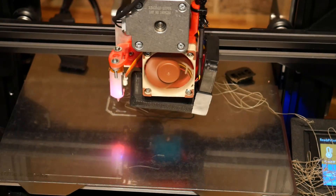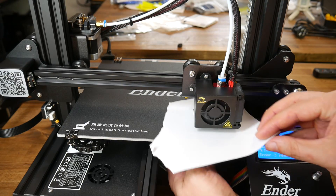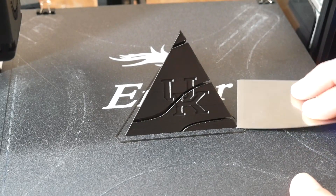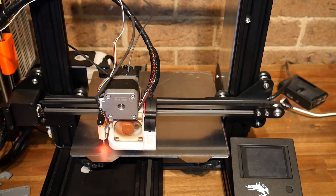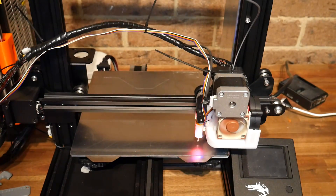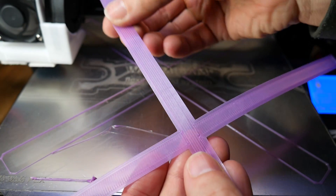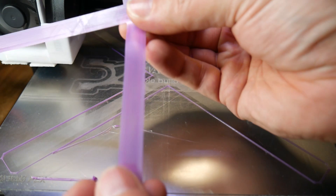One of the most common problems for 3D printer users is the bed not being level, inadvertently making spaghetti. While correctly levelling the bed is an essential skill, it doesn't mean I want to do it regularly — particularly after a sudden violent release of a part might knock things out of whack. That's why I'm such a fan of auto bed leveling, in this case the BL Touch. It doesn't matter whether my bed is crooked or warped — it probes before every print, and assuming I've done a one-time calibration of the Z offset, I can start a print, walk away, and the first layer is going to be perfect. ABL is a huge increase in print reliability.